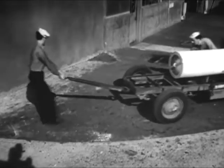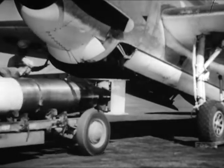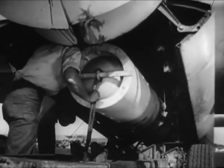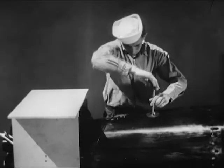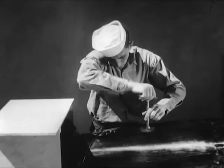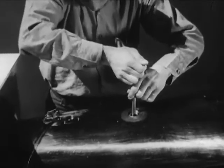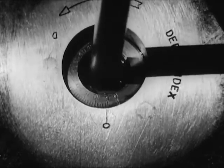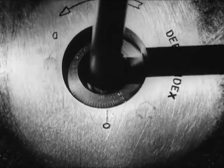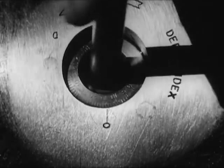With the new components, not only will the torpedo be more stable in the air and in the water with no appreciable broaching or hooking, but initial dives in 85% of cases will be no deeper than 50 feet if the proper entrance angle is used. Remember that proper depth settings must be determined for the type of target to be attacked, in accordance with tactical doctrine. Depth settings as shallow as 5 feet may be used successfully. Against armored vessels, it is necessary to set the depth to strike below the armor to achieve maximum destruction. However, take care that the torpedo is not set so deep that it will pass under the target.